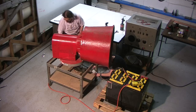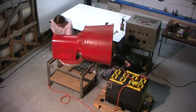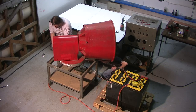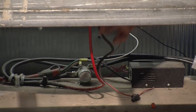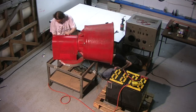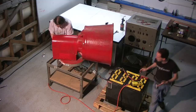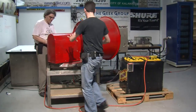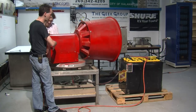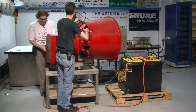The forklift battery comes through down here. We hooked up a basic forklift plug, and we've got a little 12-volt benchtop power supply that we hook to a starting solenoid. These two wires go up into the commutators, where there's a set of brushes that feeds power to the siren. We tried to keep the whole thing as intact as we could, so everything here is pretty much stock, except that we disconnected the rotation drive so that we could turn it freely. So that's the basics of what we did and how it works.